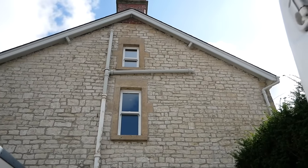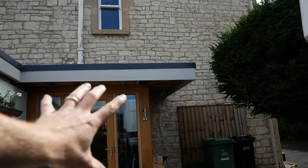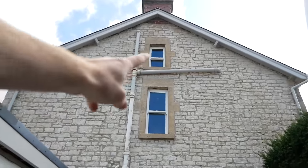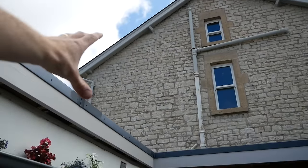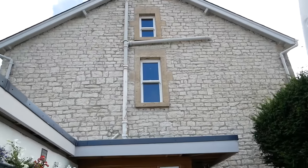I haven't told you the square meterage — the area we've covered. We have 10 metres give or take from that wall to that wall. Everyone's walls are different — we've got quite big stones up there, the joints are quite wide, so we may have used a little bit less than if you had a brick wall. You might have smaller stonework with tiny thin joints and not use half as much. So let's say 55 square metres — if you take this triangle up here, flip it over and plunk it on top, you'd get a roughly 3m x 5m square, then a 3m x 10m strip across the middle minus the window, and another bit down below.